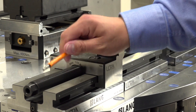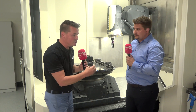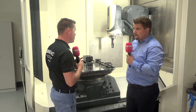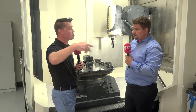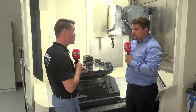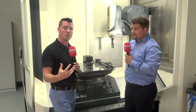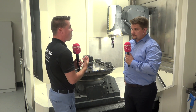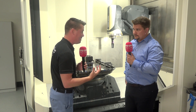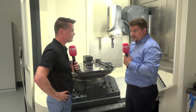That's the essential purpose of Zero Point clamping system — keeping the machine tool running. As I go around machine shops, how much time are they wasting by having to do complete removals of vises for a brand new setup? With a Zero Point location, we can change and put in new parts, new jobs, and switch over the program almost as quickly as we're switching over the vise. There are companies still losing so much time with the machine spindle not running because setup times take the longest. Absolutely — time is money, and investing in a Zero Point system pays off.